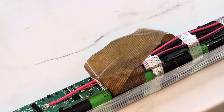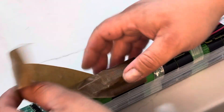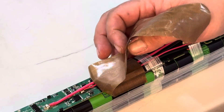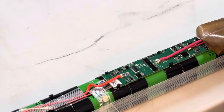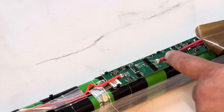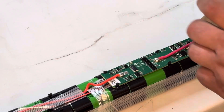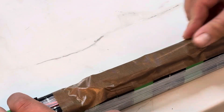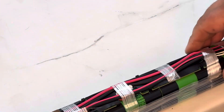After you do that, you can also do a hard reset after you let the power pass, because what you do is you avoid these MOSFETs. You just make a shunt between VP and DSG, and what it does is wake up the BMS. You cannot reset anything if the BMS is completely dead.